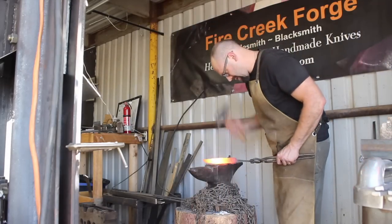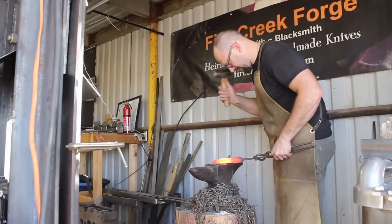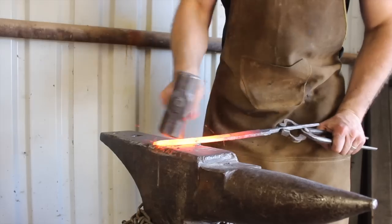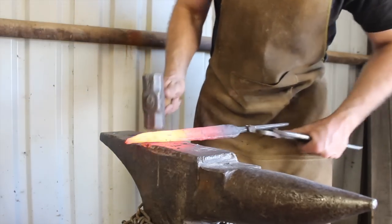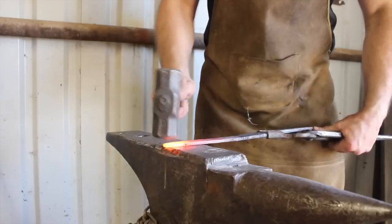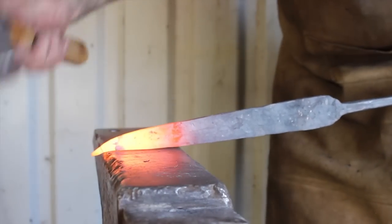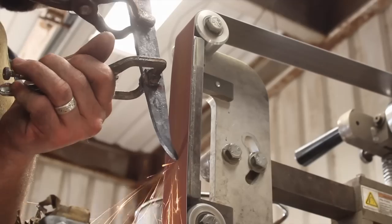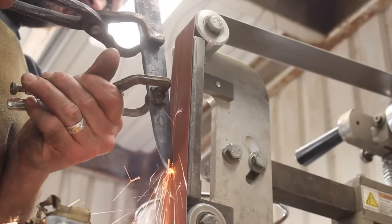Now it's time to refine the profile of this blade, get it straightened out and consistent. You'll notice the weld line at the very end of the blade is kind of off center, which is on purpose — you don't want the weld line terminating right at the tip or point. I've ground off the very end of that weld back to solid weld here, moving it over some more, grinding that little tail off to reposition the point and orient that weld line termination back away from the point of the blade.